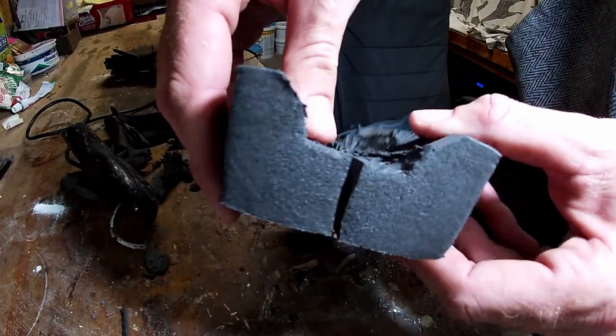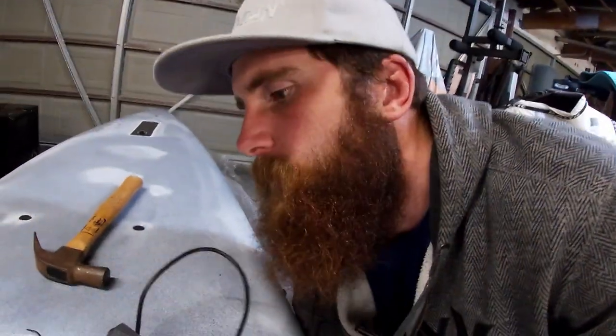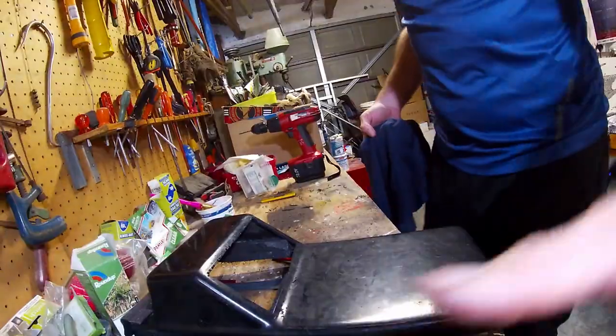You cut this little slit, then put the cable through. Feed the transducer cable through — keep pulling it. There we go — snug like a bug, pretty damn flush. A little bit of silicone on the side, not too much, just enough that it's not going to come out. I'm going to take these and try to make it flush. I measure once, I cut once, look at it, oops — measure again, cut again, measure five more times and then I get it right. But we cut the hole eventually.